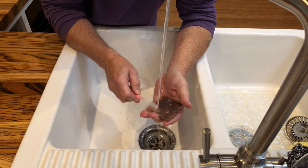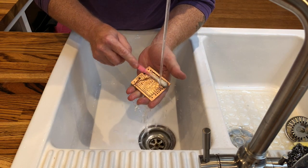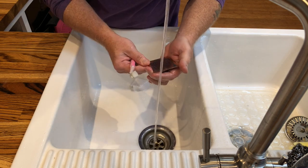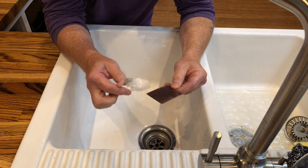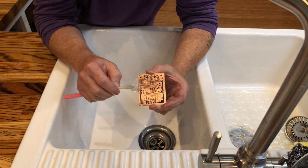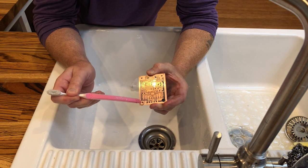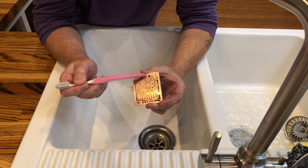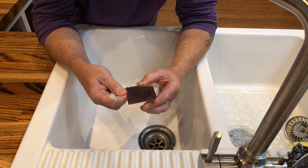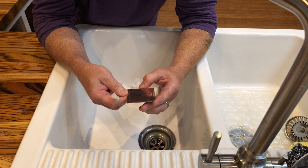What I want to make sure is that I haven't got any paper between the tracks — where all the fine tracks run, make sure there's no paper in between. It doesn't matter if you've got the white coating from the paper still there, that's all going to disappear in the ferric chloride anyway. That's 100% success right there, but we've still got a ways to go.